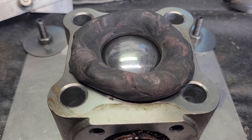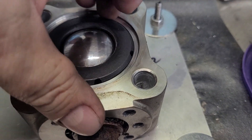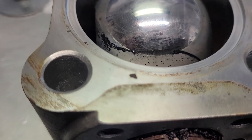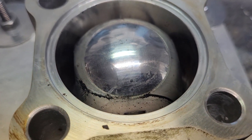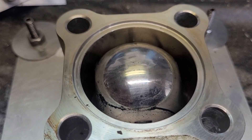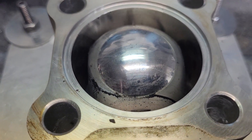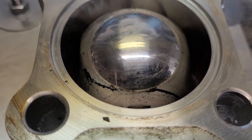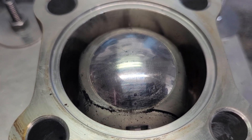If you've got any more ideas, this piece is going to be here. I think it's a cool piece. I should explain — I think I said it was for oxygen, but it's actually for liquid oxygen. That goes to our ozone system to sterilize. Thanks for hanging out. I'm hoping you got a little something out of this. Not that we use ball valves in high-performance stuff, but there is such a thing as a rotary valve engine — I always thought those were kind of cool. As you can see, they only really flow well when it's almost completely open. Something to think about in different designs.